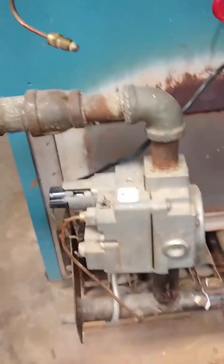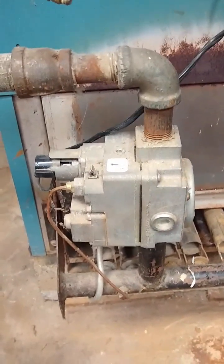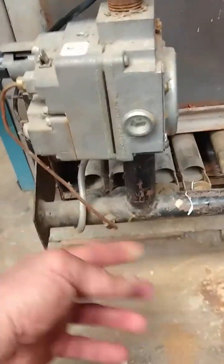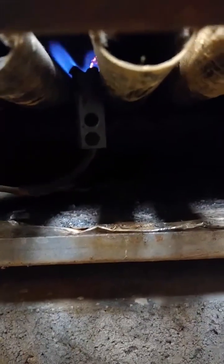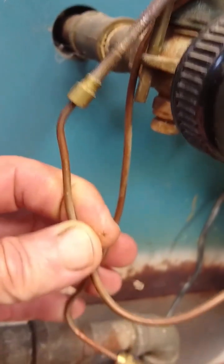There's a very, very slight possibility that the pilot light could go out. This is the gas valve. This here is the thermocouple that goes underneath to the pilot light. And if you look underneath — there, you see where those two screws are right there and there's a flame — that's the pilot light. To change the thermocouple, you have to take those two screws loose and you have to take this fitting right here off. And here's a spare thermocouple.